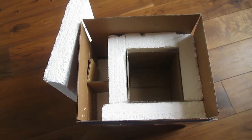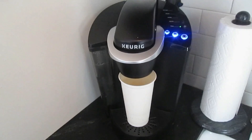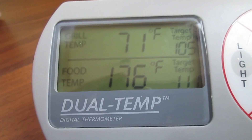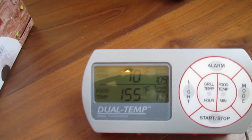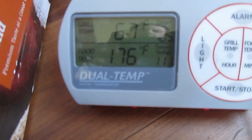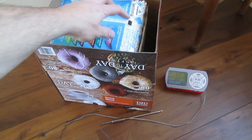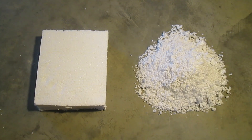For the science minds and all of us, I made a box surrounded by purchased foam insulation - two inches on the bottom, sides, and top. We'll make a hot cup of water, put it in our box and measure the starting temperature at 176 degrees and put the lid on it. 30 minutes later, you're at 155 degrees. Now I'll build a version of that same box using our ground up foam. A new cup of hot water in it goes with a starting temperature of 176 degrees, and here is our 2-inch foam top. 30 minutes later the temperature is 152 degrees. So store-bought insulation is 3 degrees or 12% more efficient. However, homemade insulation is 100% more free and fun.